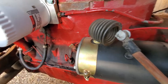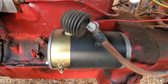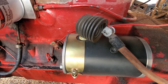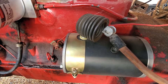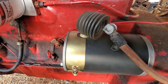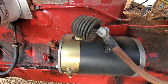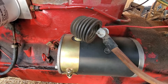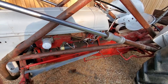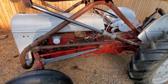Let's go ahead and see if we can start this thing up and see that spring in action. The spring is going to kind of suck together a little bit as the electricity goes through it, but it's going to take just kind of the edge off that starter — it's not going to hit it quite so hard. So as you can see, the tractor started right up, no issues, but that starter definitely did hit it pretty hard.